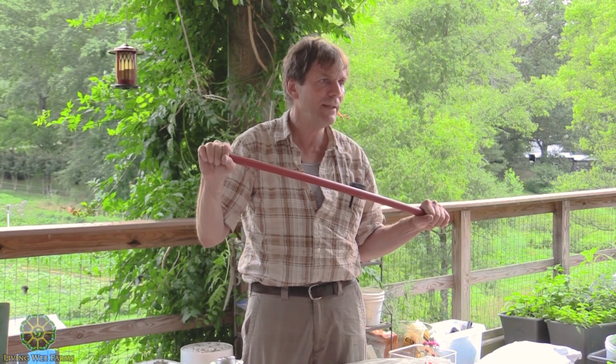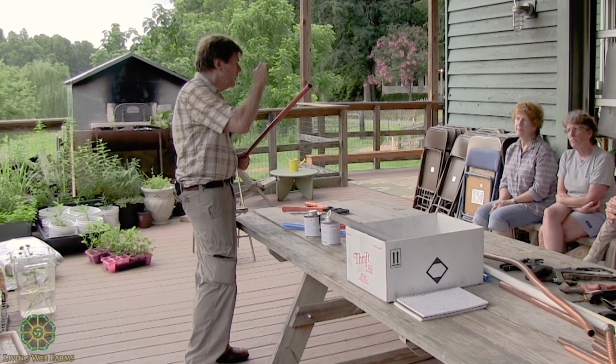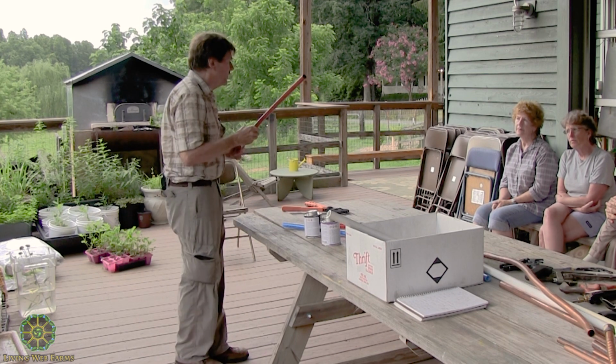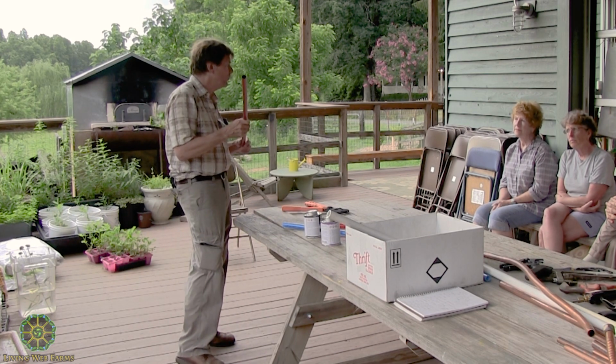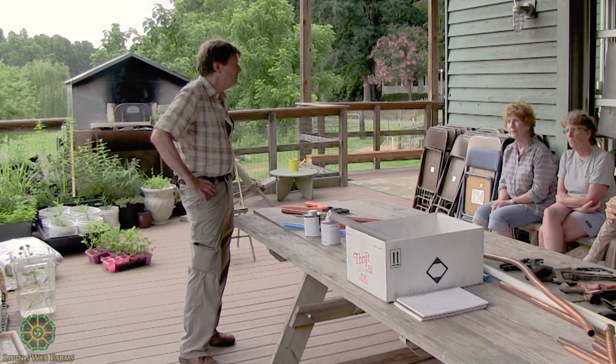But you do need a high density foam, and it'll tell you what the R value is per inch or for this size. It'll say this has R3 or R4 or whatever it is. So that's not really all that expensive. It's usually anywhere from $4 to $6 a length of 6 foot, for really good insulation. This is top quality stuff. And then you tape it.